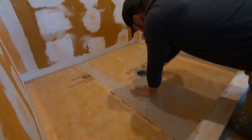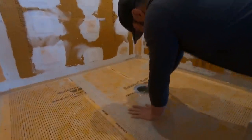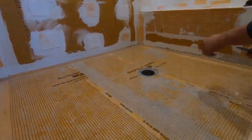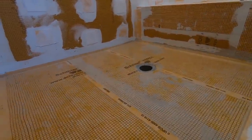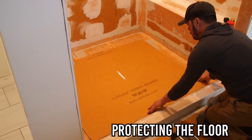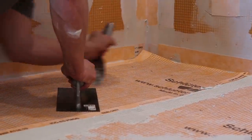The first thing I want to point out is that the water in this shower pan stayed in the pan overnight, five inches deep, didn't lose a drop. And so now we know that it's safe to proceed with putting the finished surface — the tile and the grout — on the walls over the top of this Schluter waterproofing system.